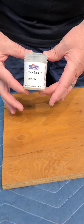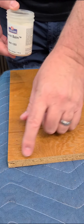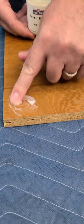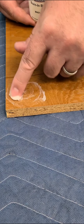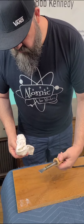What I want to do now is take what's called burn-in balm. This is a paste that prevents the burn-in knife from melting the surrounding finish or burning the wood. All you do is put your finger in there and work some around the repair area — you want it oversized, at least the width of your burn-in knife, probably a little bit more. Always keep a rag handy.